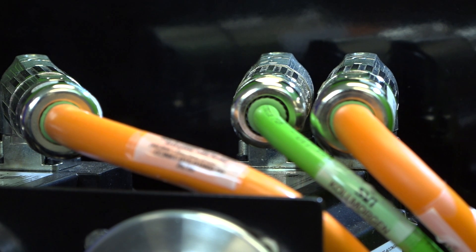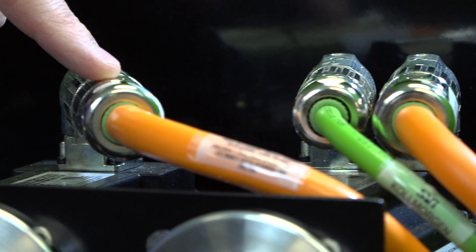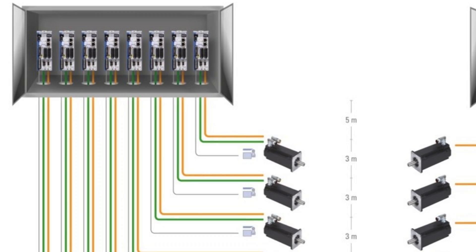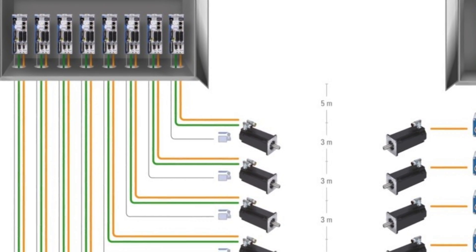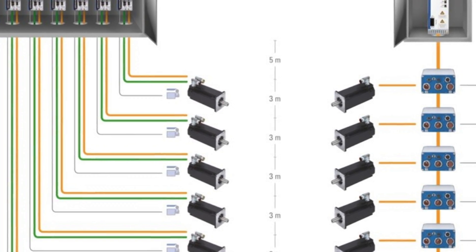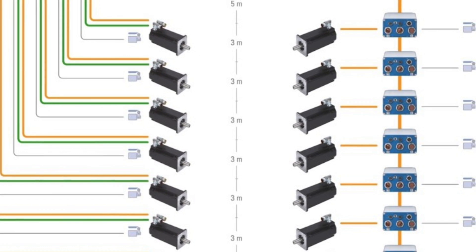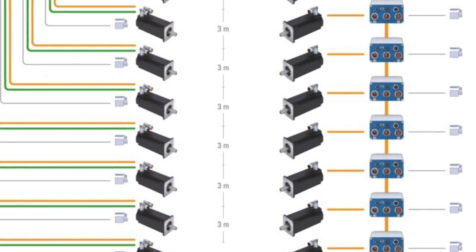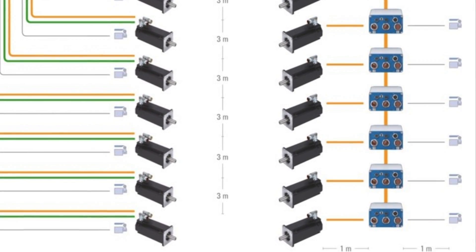From the drive to the motor will be either a dual set of power and feedback cables or a single power and feedback cable. The big advantage of the near servo drive is the reduction in cables. For a standard 16-axis system, you would need to pack 16 drives in an enclosure and run 32 cables. The near servo drive will need only the central power supply in the enclosure and two hybrid cables.